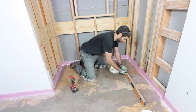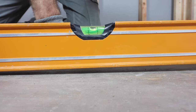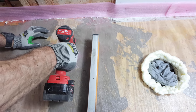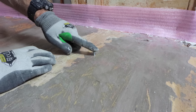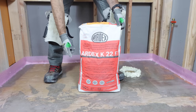I placed a level on the wood subfloor and found all the uneven spots. You can then add some screws into the wood subfloor as height indicators for the self-leveler — this will help you determine if you've added enough self-leveler to the floor. Do this around the entire bathroom floor, then shop vac the entire bathroom floor again.